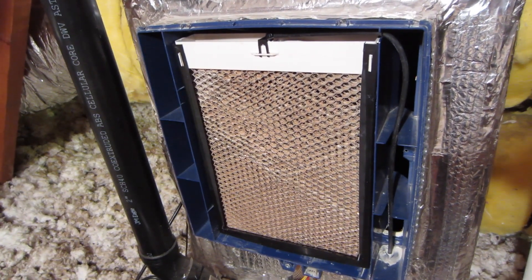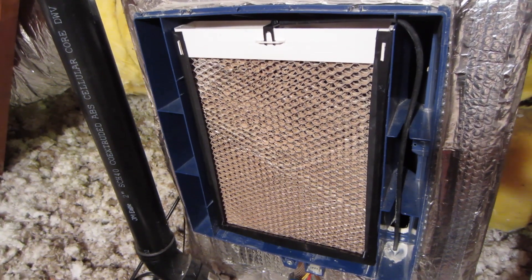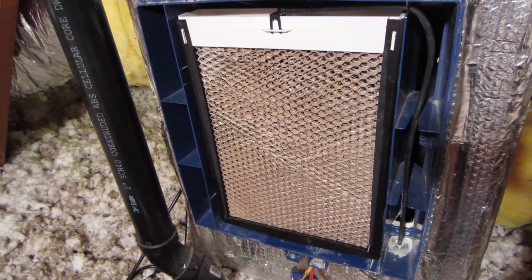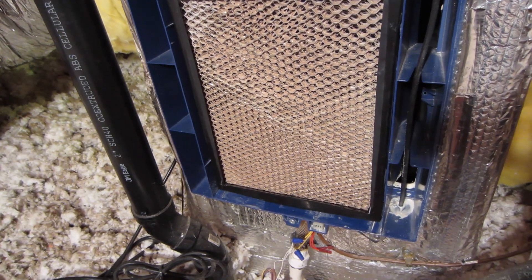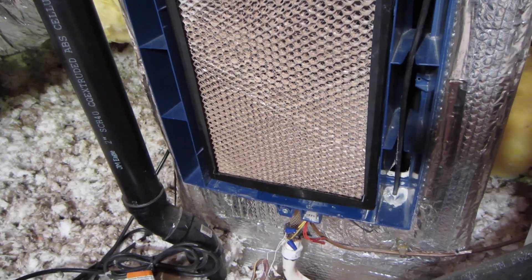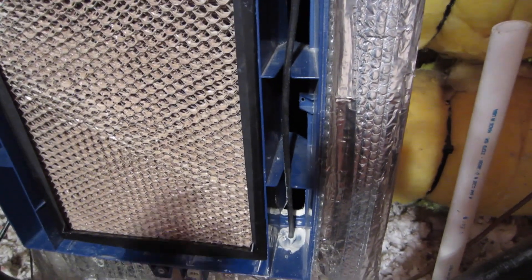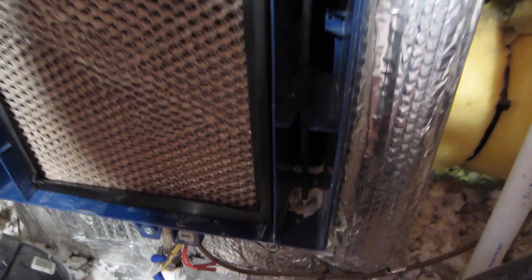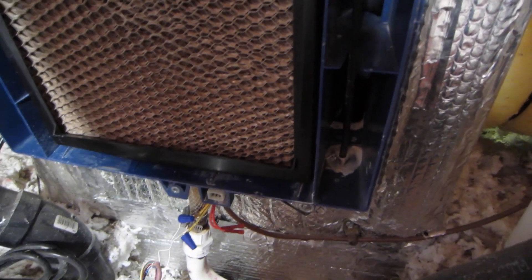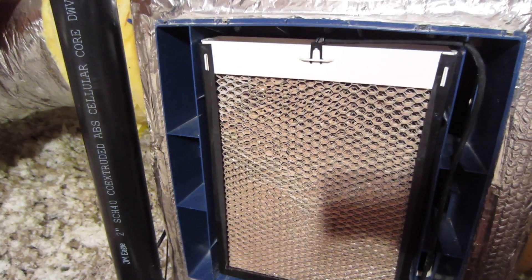We're all done. We're going to keep the pads securely in place. You got to make sure the pad seats inside the hole down below or it'll overflow. Make sure it's properly set up, your distributor tube is in correctly, and your tube is set here. The air's coming through the pad right now, then the fan will pull it through and it'll go back into the slots on both sides — that's your humidified air.